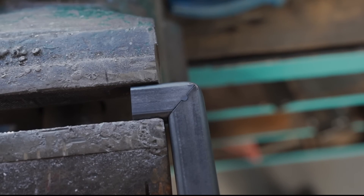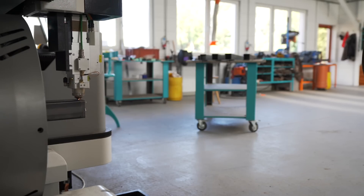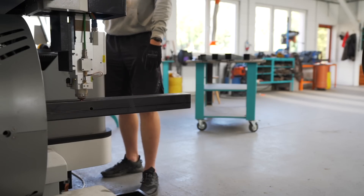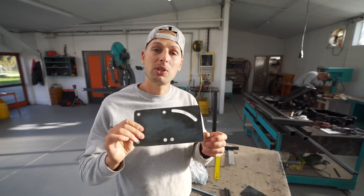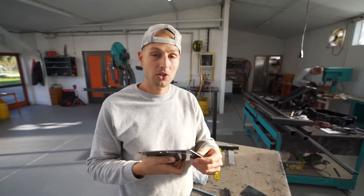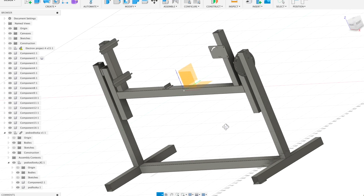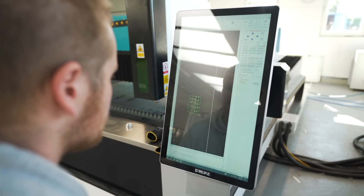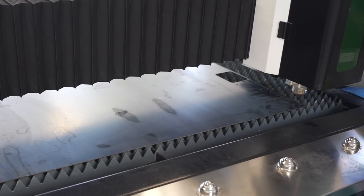Bending joints for square tubing are so practical. We can very quickly and repeatedly assemble a rectangular shape for welding. This machine is just so incredible for repetitive, accurate parts. All of these parts would take a long time to drill out, measure, cut out, grind, and shape — and this is just incredible. This is the closest we can get from 3D model to physical object with minimum effort. A model like this welding jig is maybe 2 hours to draw and likely another 2 hours to laser cut and weld together. It's incredible how fast humans can abstract this sophisticated product and effortlessly convert it into a physical object.